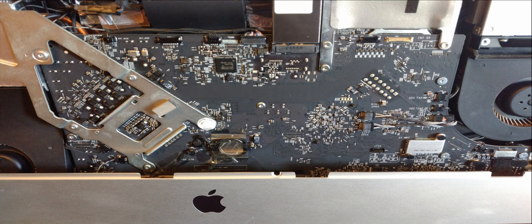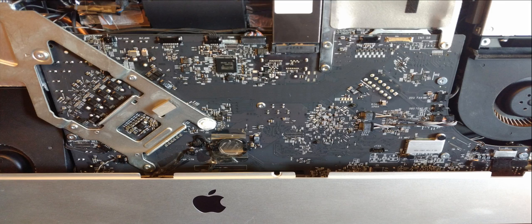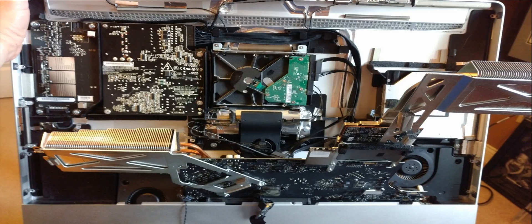You don't want to try to separate the heat sinks from the system board — you'll be pulling those out with the system board, so leave those in place. You'll find connectors here, here, here, and here. There are three here, then four or five down in that location, and a couple over here as well. There are also a couple more in the middle of that board. Just take your time, take a good look at the board, and it's no big deal.